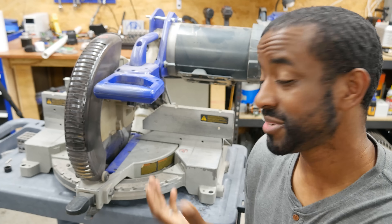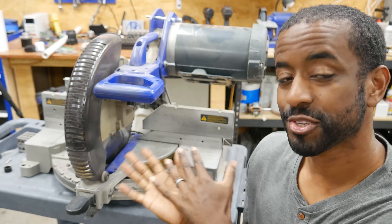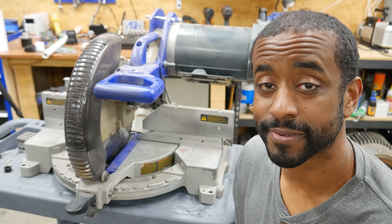You could also simply experiment through trial and error, which is what I did with this miter saw build — there's a whole video dedicated to that project in the description. What I've shown you so far are the easiest methods for getting through most DIY projects. If that wasn't sufficient, you're gonna need to do a little more math. There are lots of formulas online for calculating rotational inertia — basically a measurement of how difficult it is to get something to rotate. You'd figure that out for each part of your system, add them together, and that lets you calculate how much force is needed to get everything spinning. That information is available in the description along with more video links.